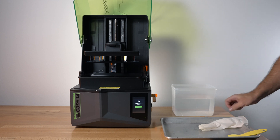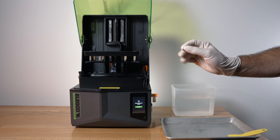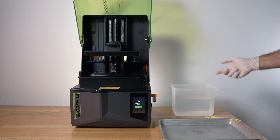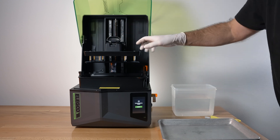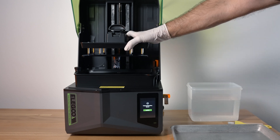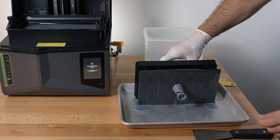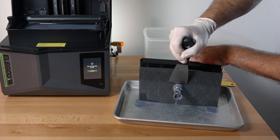Make sure you wear your protective gear — I'm just going to use one glove now. Because this is water washable resin, we can use regular water instead of alcohol, which is a lot smellier. This is why I like washable resin — it's more friendly. The good part is none of the top of the printer gets resin on it, just the bottom part. When you pull the build plate out, keep it pretty level and then tilt it when you get to the sheet as there will be some runoff. Let's see if we can take this off.